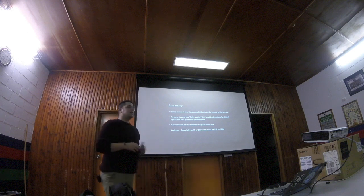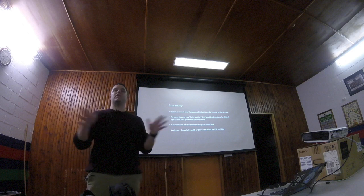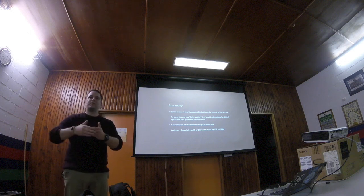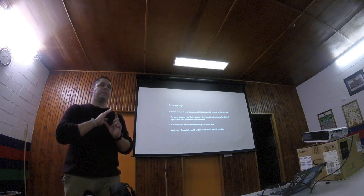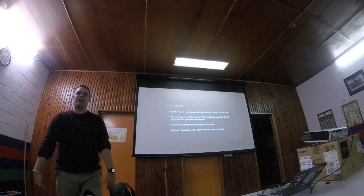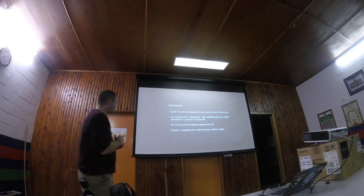The keyboard mode of JS8, I'll cover that in a bit more detail, but essentially it's running to FT8 level. So if anyone has never heard of FT8, never used FT8, FT8 transmits in 15-second windows, listens for 15, transmits for 15, listens for 15, and I think it's only about 77 bits. Yeah, good, thank you. I was going to say we're passing about my thimble full of information. It's lapping around the ankles. So it's very small amounts of information.